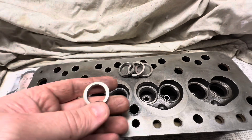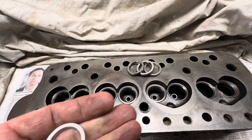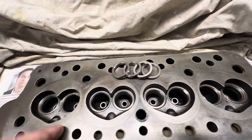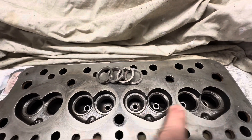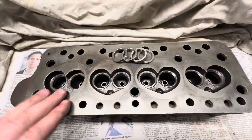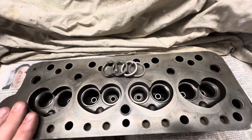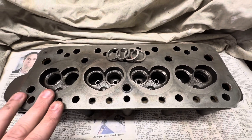The first thing I'm going to do is fit these valve seat inserts to the exhaust, converting the cylinder head to unleaded fuel. Because at the moment there are no inserts — that's just as it came from the factory. And then we're going to let it sit just to make sure we don't have any cracks after doing that, and then we're going to continue with the machining.